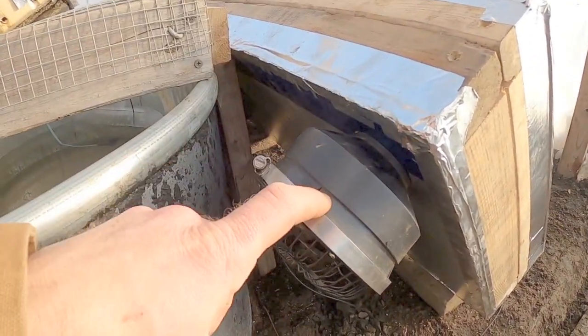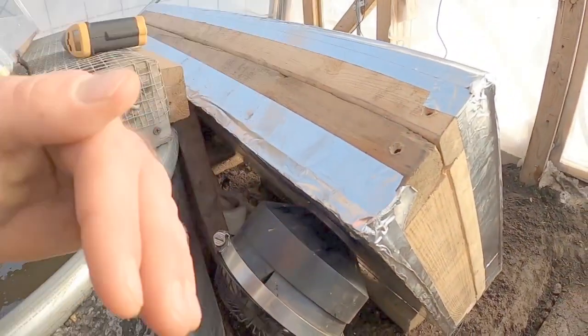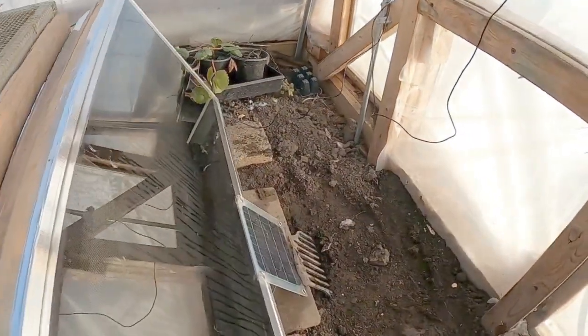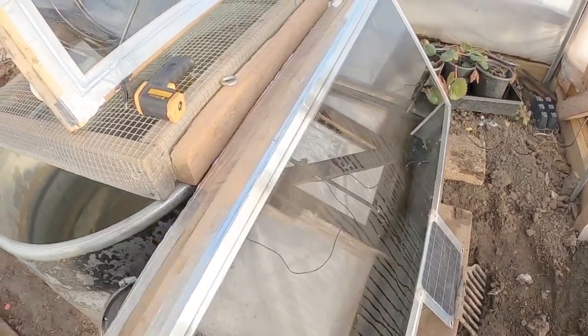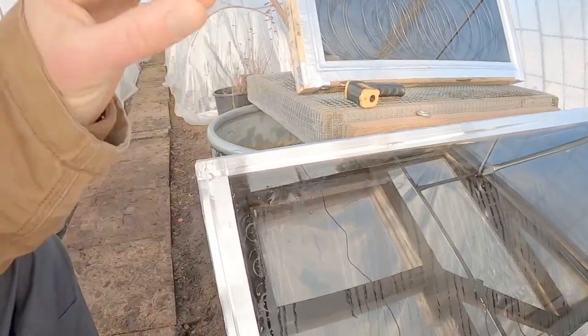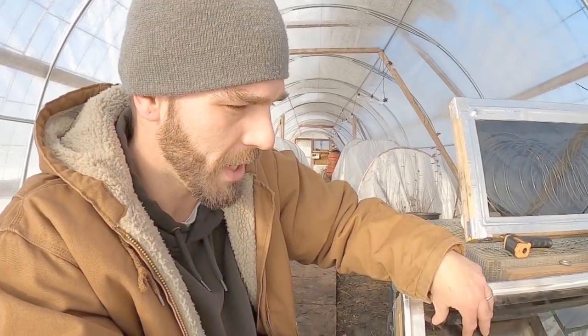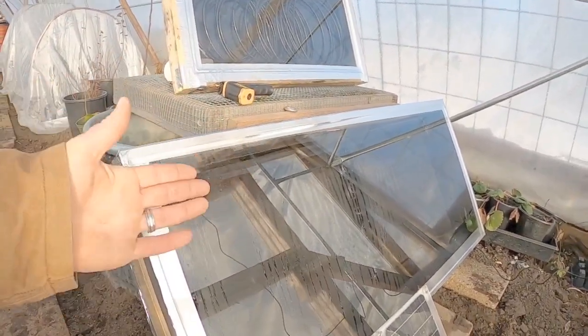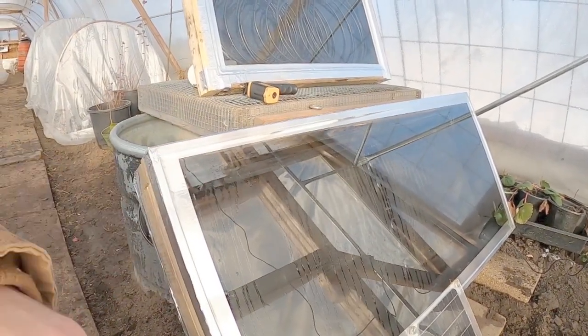I put some slits in this so I could pop my fan right inside this little downsizing gasket — it's about 2 inches on the other end and about 4 inches on this side. On the inside I took one of our hose clamps and clamped it so it will not pull back out, then slid my fan in, clamped it in, and it is blowing some decent airflow out of there. It should get all of that condensation cleared — it's definitely not as condensed up as it was when I first started. I wish it was a little easier to see inside here. You can see all of the old air conditioning parts — it looks like an old radiator, and that's what I called it, but this actually was an air conditioner. I painted all of those fins inside the box and all of those fins are going to create a lot of surface area — tons and tons of surface area. Anybody can take pop cans and throw them in a box to make a pop can solar heater, but this is my own unique spin on it. I wanted to use an old recycled air conditioner I found on the side of the road — one man's trash is another man's treasure. I'll come out and show this on a cloudy day so everybody can see into the box because right now it's getting a lot of reflection.